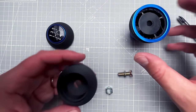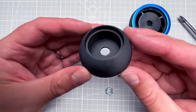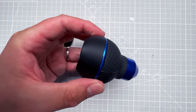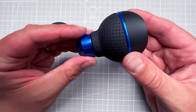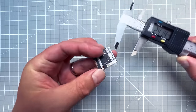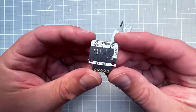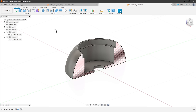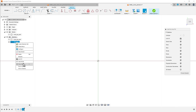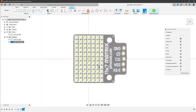This is how the captured timelapse looks. And here is the actual 3D printed piece. I can use the nut and bolt to screw it to the original shifter knob — it fits nicely. Now it's time to fit the display, so I use calipers again and measure all the dimensions. Then back in Fusion, I create a new sketch on the bottom plane.